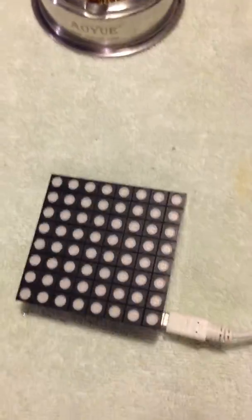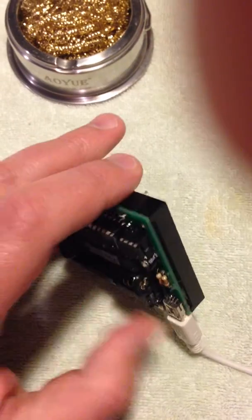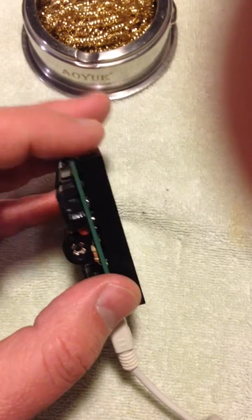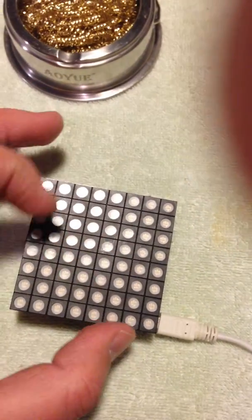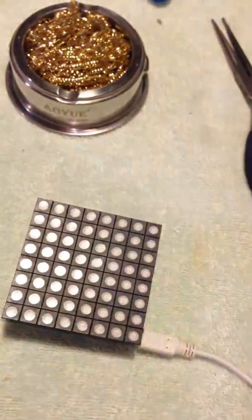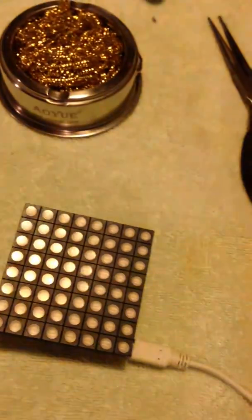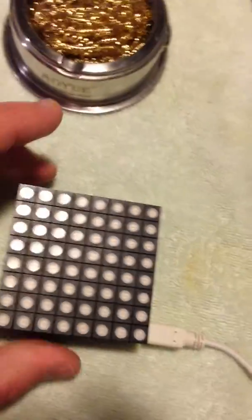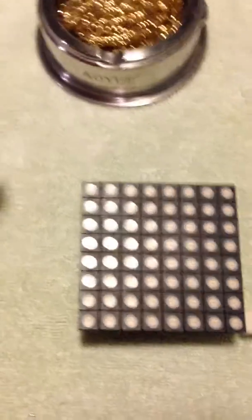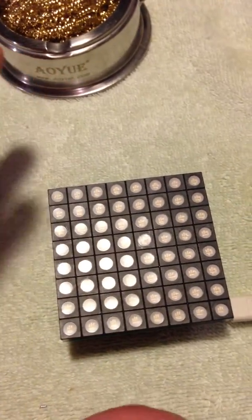The matrix itself — the 8x8 matrix — is probably the hardest part to solder. What I found works best is that it's the last component you put on after you've soldered everything else. Before you put it on, go through and inspect all your solder joints. I use a magnifying glass and a bright flashlight to make sure all the solder joints are nice and shiny with no cold solder joints, ensuring the best conductivity. Make sure all joints are complete, tight, and there are no solder bridges.